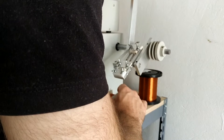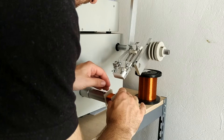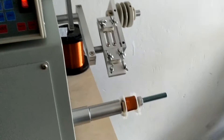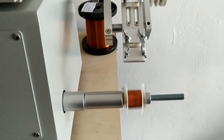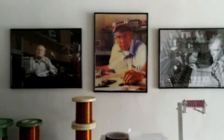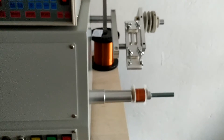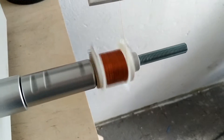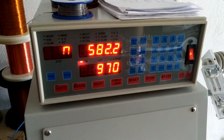If you use the same wire gauge for both primary and secondary, the big advantage is that you can just set two different numbers of turns but keep all the settings the same, so the tracking and everything else is adjusted perfectly. You just switch from primary to secondary. With a PCB bobbin, you don't even have to think about the leads — you just remove the insulation and solder the wires directly to the pins.